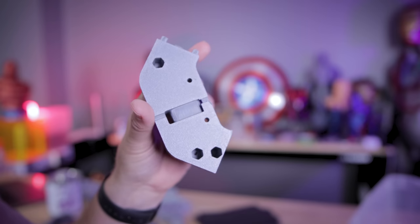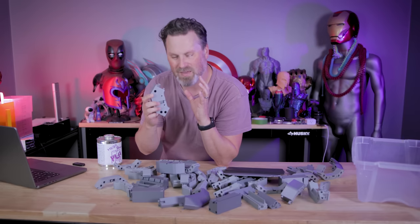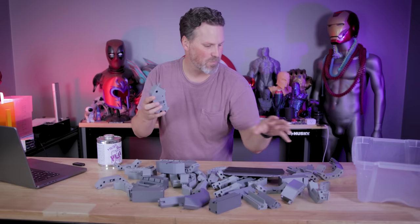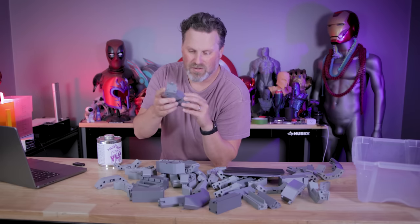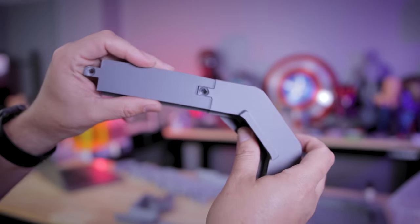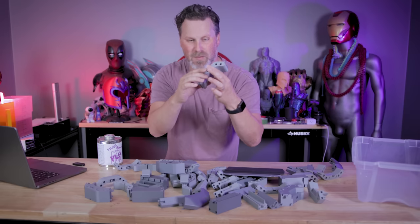Typically when you're assembling these, there are openings for bolts that you can use to mount the parts together, adding durability as you're snapping them together. They've said you can print these without supports — I ended up using some snug supports in PrusaSlicer and was able to easily remove those. I did have a little bit of stringing from the overhangs on parts printed without supports, but nothing bad that I couldn't easily clean up. As part of the assembly process, you will want to use some bolts to assemble this. There is also a core set of files that you'll use to build out the depth of the modular display pieces.